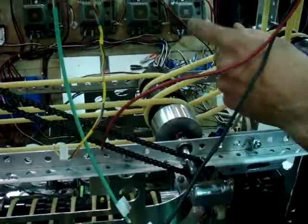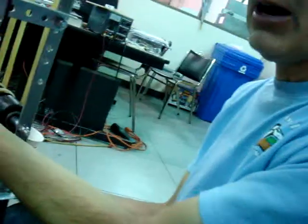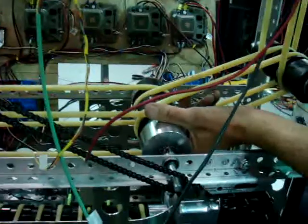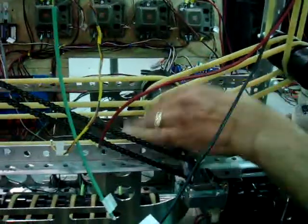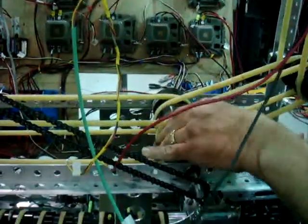Only a certain diameter can wrap around the drum. The bigger, thicker material has to have a larger drum that it's going to go around. For that material, we could use a 2-inch drum. Some material we'd have to use a 4-inch drum. So that's why we're using this 2-inch material, and we designed the robot around that originally.